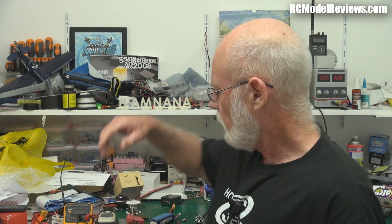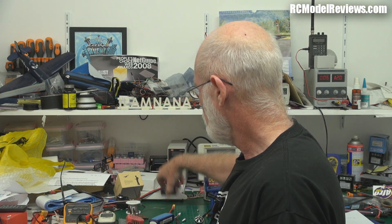Well, there you have it — a couple of motors, not too bad actually. If I had to choose between the two, based on the circlip spinning on the shaft alone, I'd actually probably go for the Quantum. It's got a bit more power at the top end, it's more efficient, and it seems to like 5x4 props better than 5x3 props. It's more efficient at the hover thrust with a 5x4 on it than it is with a 5x3.